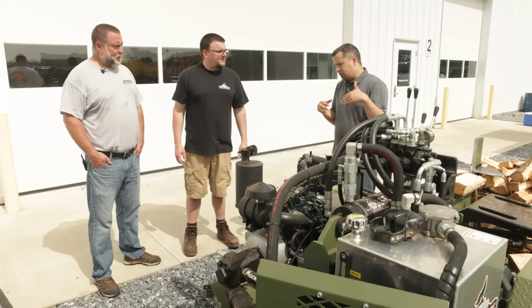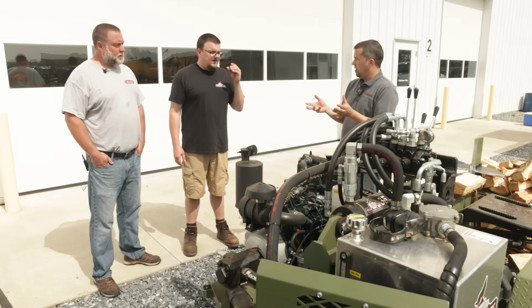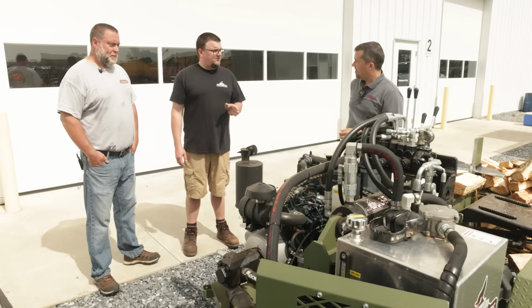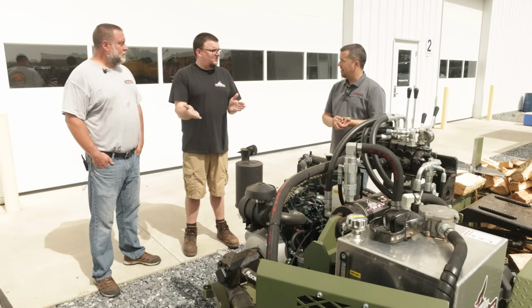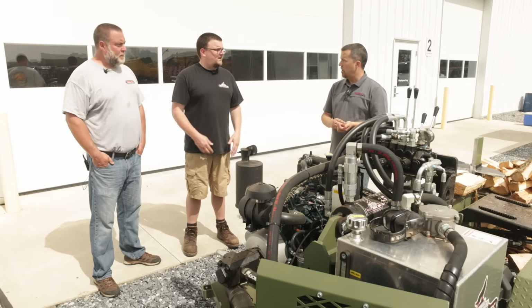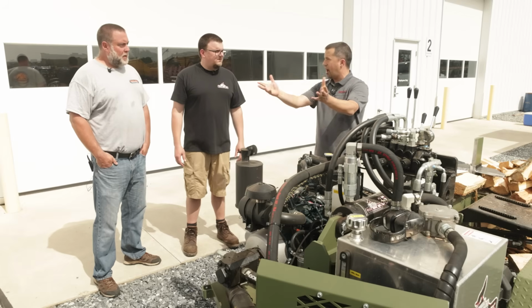So most of what you're getting between those engine selections is torque differences, right? Well, horsepower and torque, but okay. The biggest thing, the IGX 800 is also 25 horse, and the diesel is still 25 horse, but the torque on this is massively larger than the IGX 800. You can notice that when you push a big piece through a complex wedge.